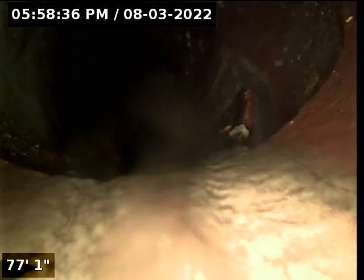At 77 feet, it looks like we're going to drop in depth again. Some of our lines are offset here, and that is putting us into a city sewer situation. Substantially larger pipe. We're about 103 feet out. Believe we're in the city sewer main.